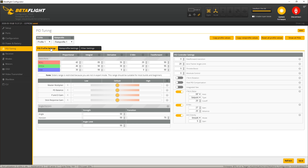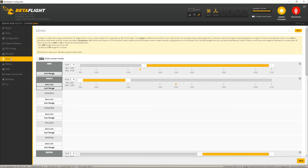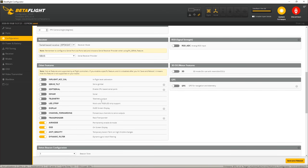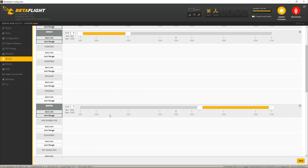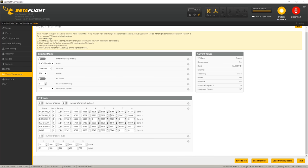It didn't end up being too much of a problem because Betaflight stock PIDs tend to suit a heavy freestyle model. It's not unusual if you have to customise the Modes tab to suit your radio, but they had only set up Angle Mode and Arming on Auxiliary One, so if you don't change anything, the model will only fly in Angle Mode. They hadn't set up a Lost Model Alarm, and D-Shot commands weren't enabled either, so I added both of those because there's no physical buzzer on this model, and it ended up getting lost in some trees, so I'm really glad that I did. The VTX table was set up correctly though, so that's a plus point.